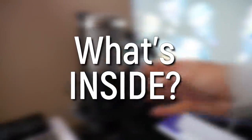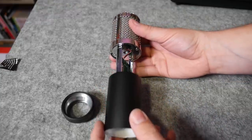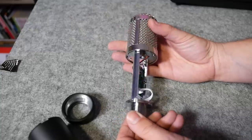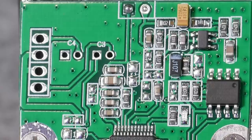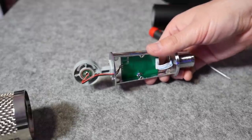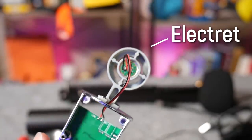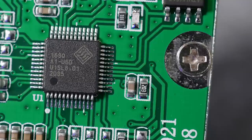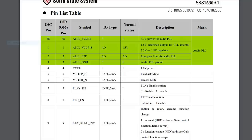But we just have to know what's actually inside this cheap microphone. Opening it up is surprisingly easy — you just unscrew the threaded base, which is actually pretty well machined, and the metal tube comes away revealing the circuit board labeled 'LCS USB 921.' I'm not really seeing any large capacitors or evidence of any sort of phantom power supply, and in fact a large portion of the board is unpopulated. Undoing two screws reveals an absolutely tiny capsule — this is in fact an electret. It's a kind of condenser microphone but it doesn't require phantom power at all, and quite frankly to call this a condenser microphone is very sneaky. It looks like all the heavy lifting is being done by a specialty USB headset line-in controller, which is actually pretty fascinating.